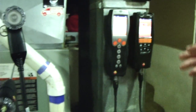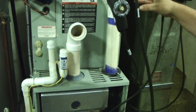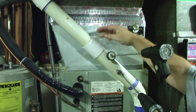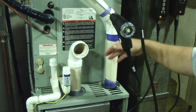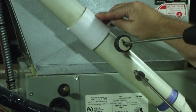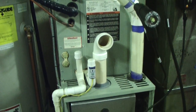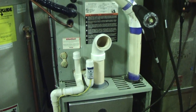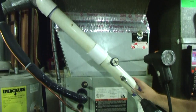What it is, guys, is when the original furnace I had before I put my American Standard in, I had an old Tech 4 furnace and I had 2-inch piping on that. When I reinstalled this furnace, it was during a blizzard. So basically all I did was I lopped it off right here and I just put this piece in and this coupling. And I got on the data chart and this actually needs to be 2½-inch PVC run out. That's why it's so hot.